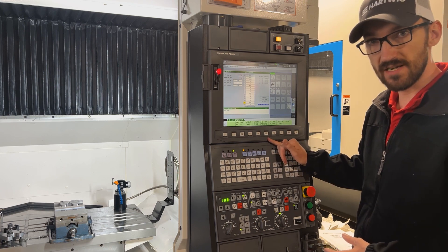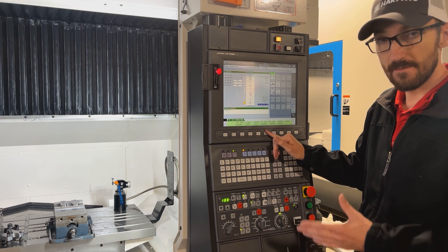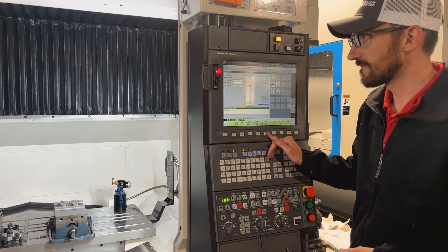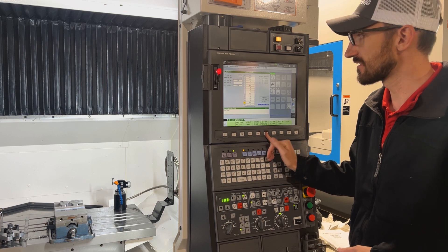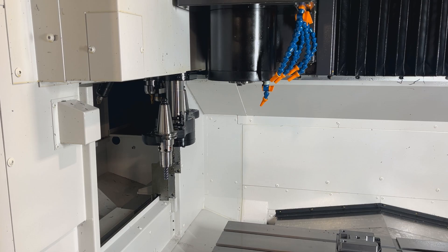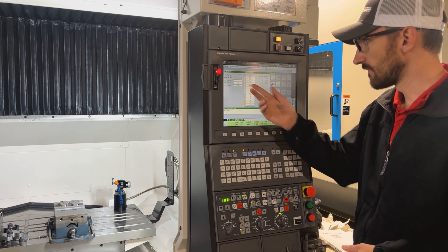You'll see several keys down here. I'm looking for ones with a green flag above them — anything with a green flag indicates that I can take a step forward. This is one step advance. When I push it, the machine is going to move, so I want to be a safe distance away with nobody in the way. The mechanical motion is quite aggressive on some of the tool change functions. I may have to hold it down or touch it multiple times. I'm watching the sequence number change and I want to see it get to sequence number one.